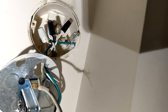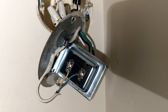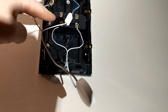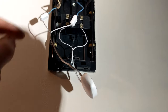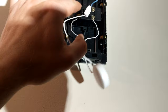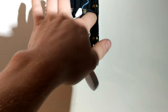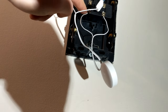Mount the transformer back up and connect the last two wires. You might have it in your electrical panel or somewhere in your garage, but that's basically how it goes. Once it's plugged in, mount it up and let's get going. Once mounted, if you have a four-wire doorbell system you'll have to follow exactly what the Nest tells you. But if you have a two-wire system, it's super simple — in this case we just have these two white wires here.